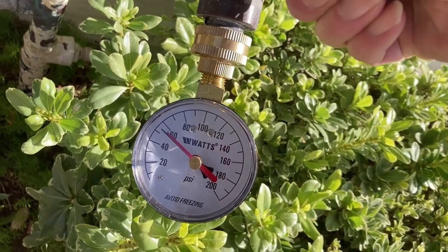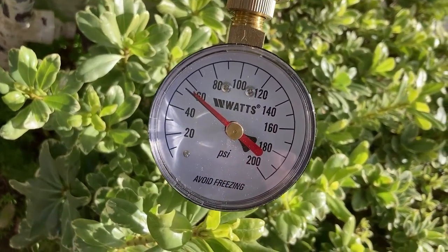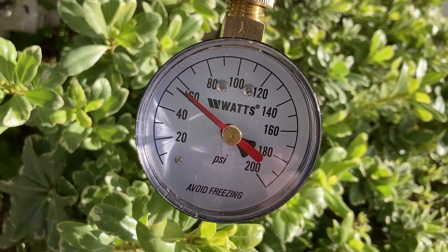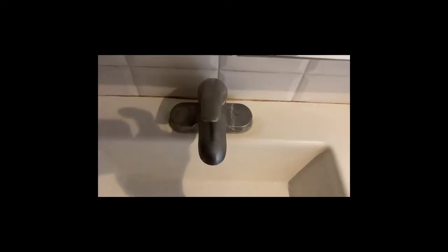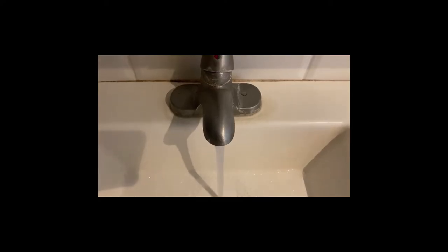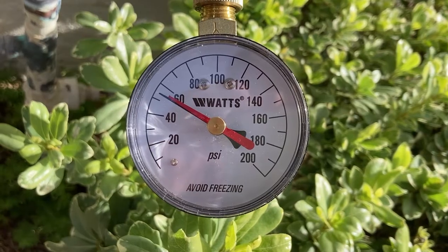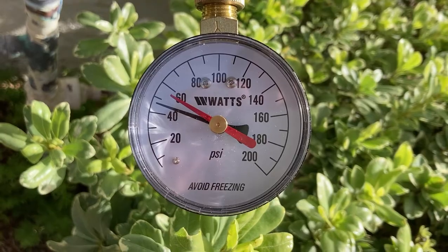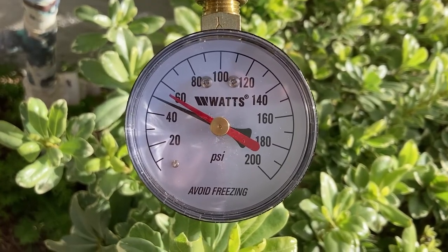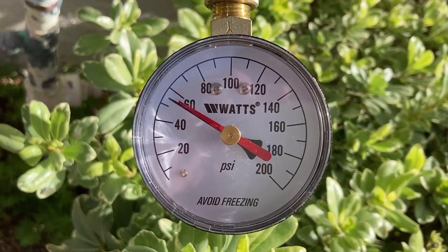Check the water pressure. Now the static pressure in the home is 55 psi, much lower than city water supply pressure. So this new pressure reducing valve works properly. Open the faucet, the pressure change in the first several seconds is not obvious now. The running pressure is 49 psi. When the faucet is closed, the pressure comes back to 55 psi quickly and stays there.